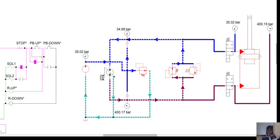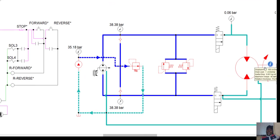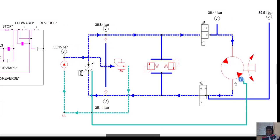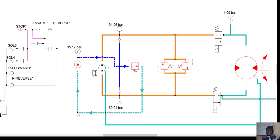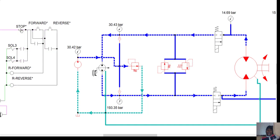Now let's look at a closed loop system with a hydraulic motor. This is similar to the cylinder system but there is no load on our motor. When we go forward, the motor keeps rotating, and we can go the other way too. The pressure set point is turned down, and because there is no load on the motor, the motor is freewheeling. To summarize: a closed loop hydraulic system is one that doesn't suck from tank and doesn't return to tank. A feed pump supplies feed pressure into the line, which the main pump uses to carry out pressurizing and do work.